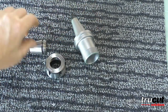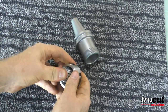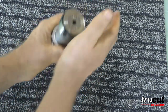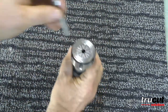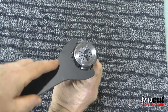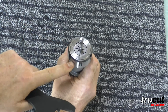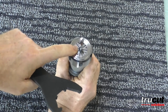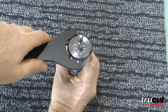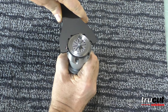Basically, when you fit your collet into our nut, pop that in there and then put it into our tool holder and put our tool in. What happens when you tighten up that last little bit is the actual middle of the ball racer is not moving and the outside of the nut is moving, so that stops it from grabbing onto the collet and tearing it up, and you're also going to get a tighter fit onto your actual tool.